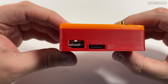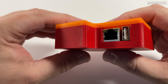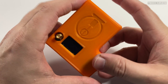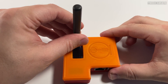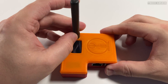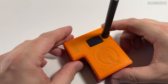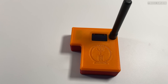To answer the question of why — it's simple. Nearly all MMDVM hotspots run from a Raspberry Pi, which is a single board computer. However the current state of the market means either over-inflated prices for old stock or Raspberry Pis are simply not obtainable. So the Fire Spot runs on the Orange Pi. The Orange Pi is a single board computer and fully supports MMDVM and Pi-Star. In fact, Orange Pi has greater specs which can beat some of the Raspberry Pi models, meaning faster boot times and greater performance.